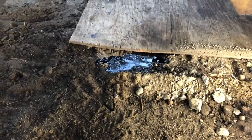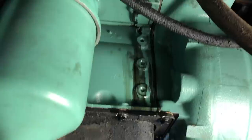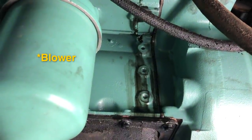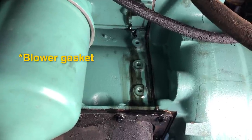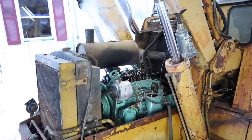Bad news — I just checked under the engine and there's a big puddle of oil. If you look up you can see oil dripping down from underneath the airbox, so it looks like the airbox gasket gave out and is spewing oil all over the place. If I go back to the clip of the last start attempt, at the very end you can hear a popping and oozing sound when the blower gasket blew out. I just ordered a new blower gasket so I'll replace that in the next video. If you like the video give it a thumbs up, and don't forget to subscribe if you want to see how this turns out. Thank you for watching.